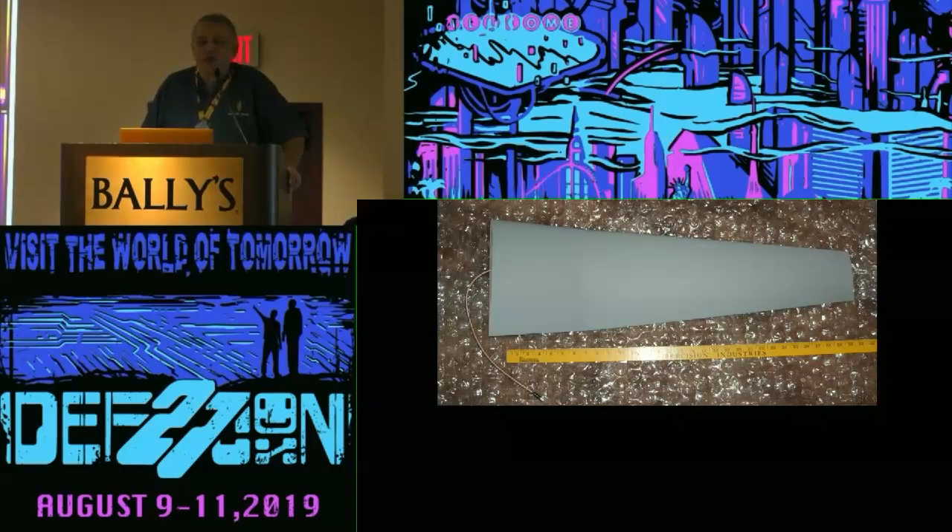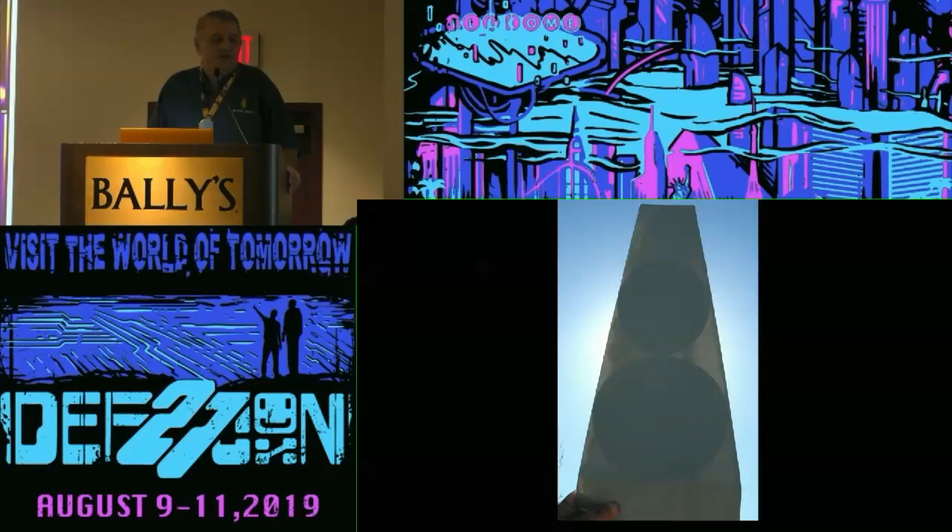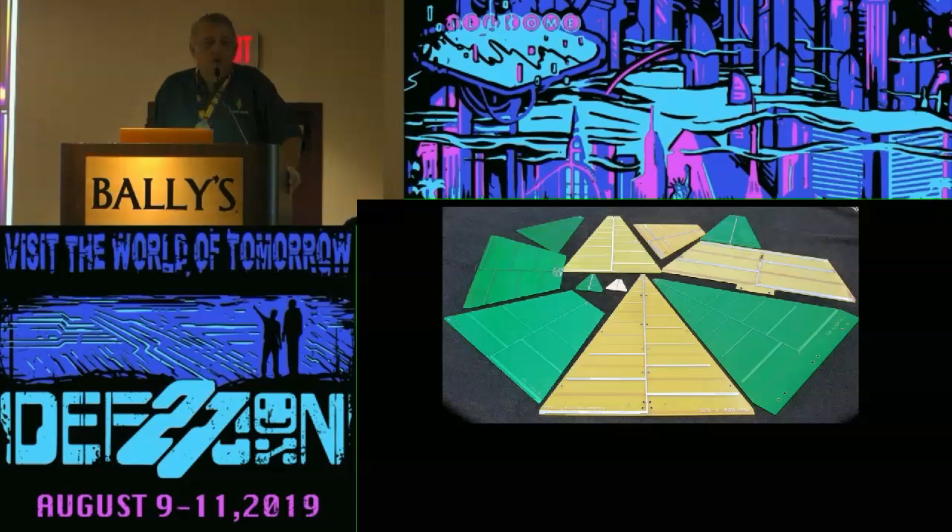This is a winglet off of a long-duration UAV designed for 11-day flights, powered by a 9-horsepower diesel engine. Why diesel? In forward military areas, jet fuel is easier to find than gasoline. This is the winglet — not quite three feet long. They sent it to me for testing because if you hold it up to the sun, you can see what we have inside the wing layout: log periodics.